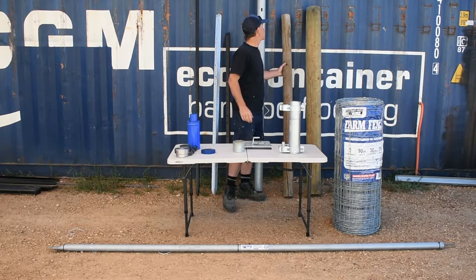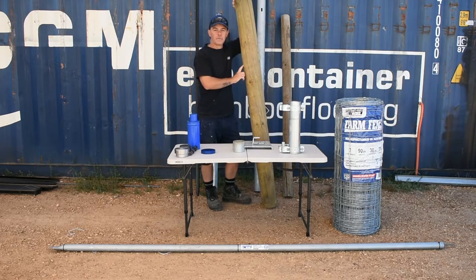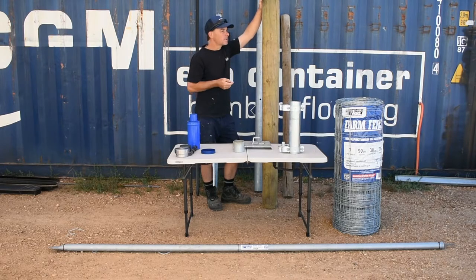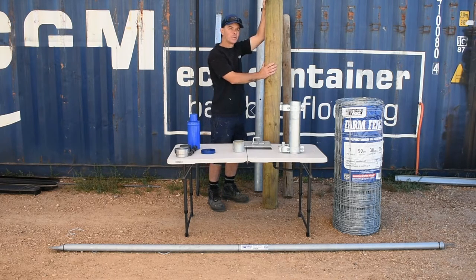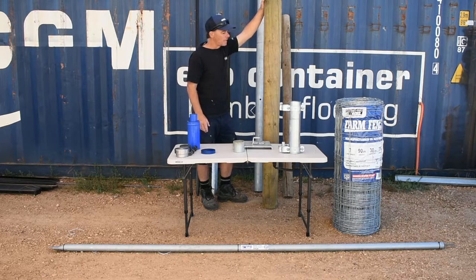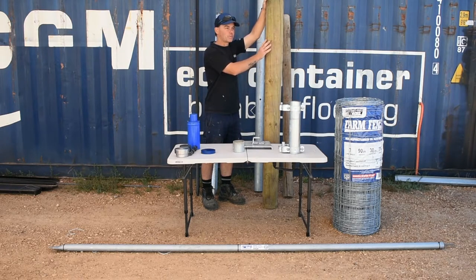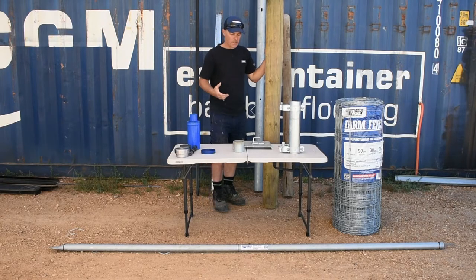To hang a gate off a pine post, you really need to use a minimum of the 5 to 6 inch or 150 mil post for strength, and a 2.4 meter height is usually a good size. Remember that you need two posts plus a middle piece for your strainer assembly. Then you drill the holes and staple or attach the single strand wire or barbed wire depending on what you're doing. There are a multitude of uses for pine, but it really comes back to cost — the initial outlay for materials is cheap, but the installation cost will be a lot higher than some other materials.